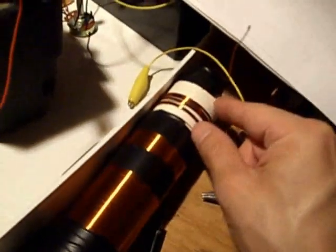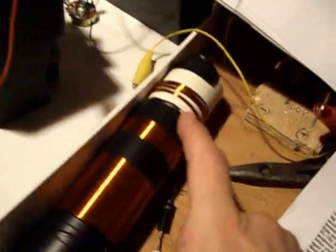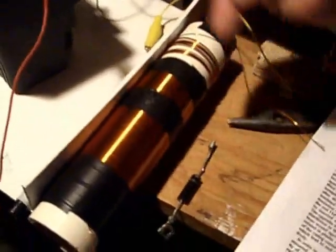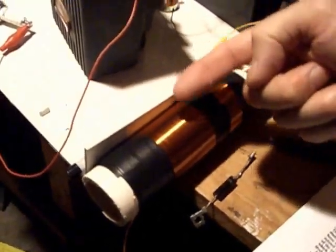Out of the whole patent there are just a couple of things to really pay attention to. The wire is preferably 22 gauge. The first section comes from the ignition coil — that's the first section; the entire next section is the second section, broken down into three sub-sections. The winding off the first coil goes one direction, then you loop it and wind back — forty-eight turns, loop, ninety-six turns, loop, come back forty-eight turns.